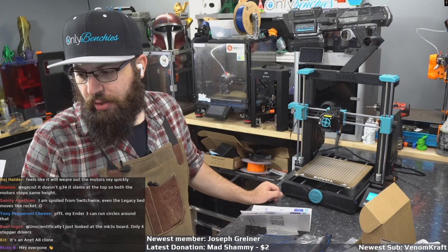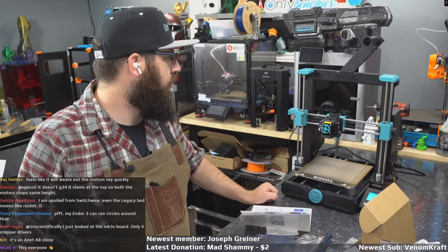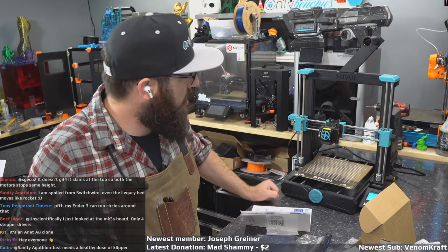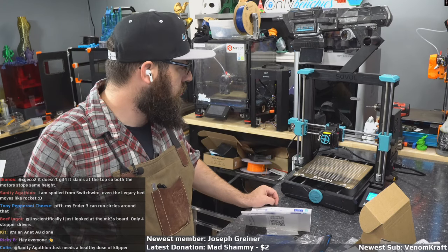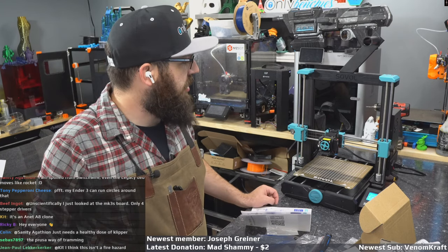Rookie B, hello. Yeah, the Mark III board only has 4 steppers. And see, they're actually smart. They have the offset set so that it's probing in the middle with the probe. You'd be surprised how often that isn't the case. Yeah, TR8 lead screws. Yeah, they're TR8s.